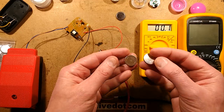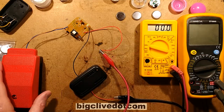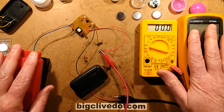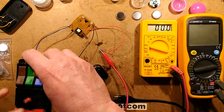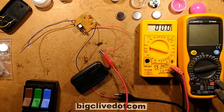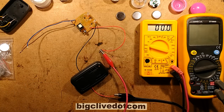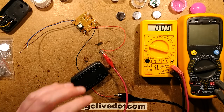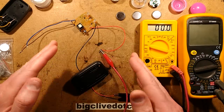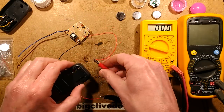I've measured the voltages. The red LED stays on until the cell is around 4.13 volts, which is approaching the 4.2 volts desired. The green LED starts lighting around about 3.96 volts. So there is a point where both LEDs are active — the red one flashing and the green one lit — to show it's kind of fully charged.